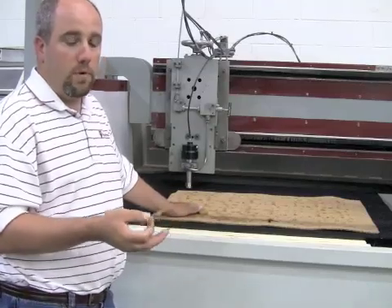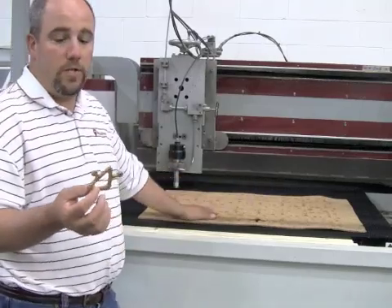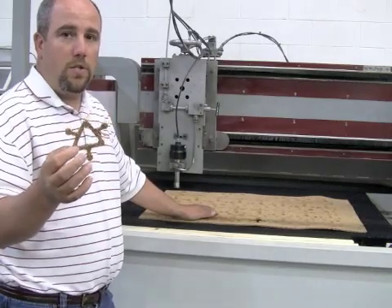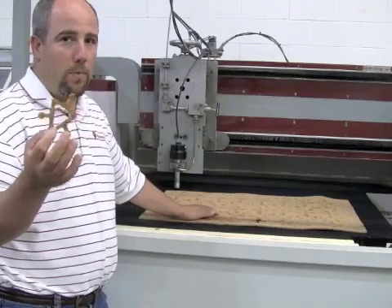In this application the brick was wonderful. What we'll do here in a second is undo it and show you how easy it is to take the parts out. The other nice thing is there were no tabs that we had to do on the part, because the bricks held the parts in place, so part retention was 100%.